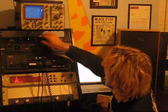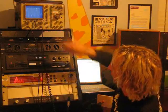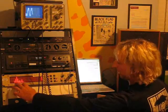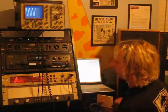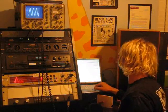Now here, let's go ahead and bring it up. Look at that, the waveform's definitely got some curving to it. We're seeing harmonics already at our 100 cycle. We're seeing harmonics all the way up at 315, so that's about 3 octave, octave and a half up.